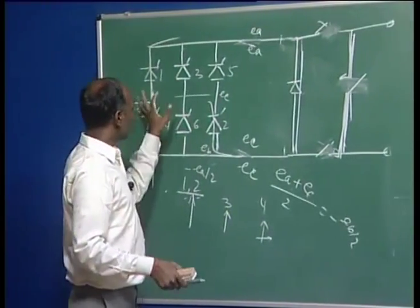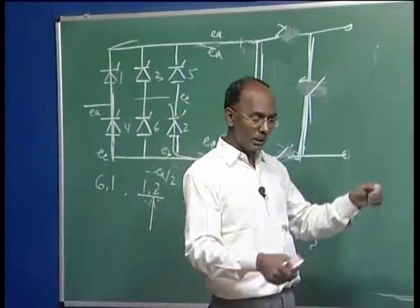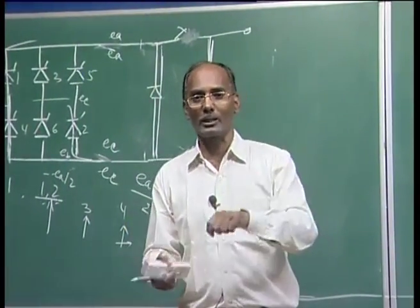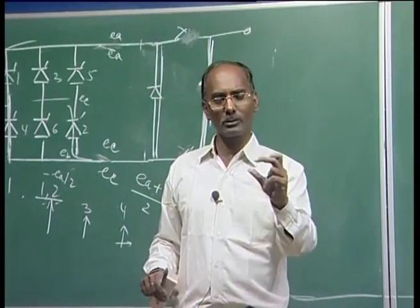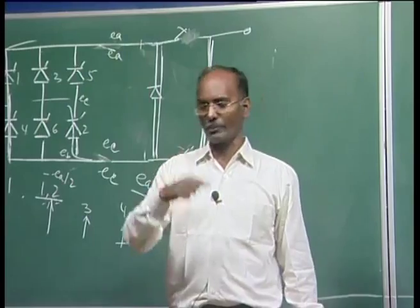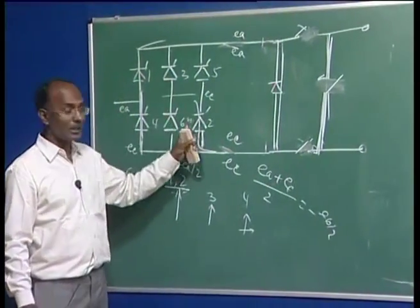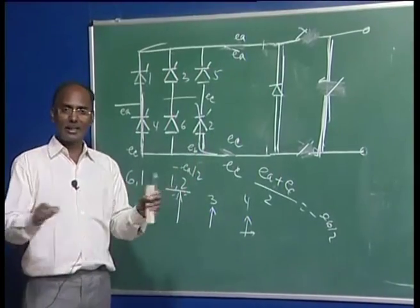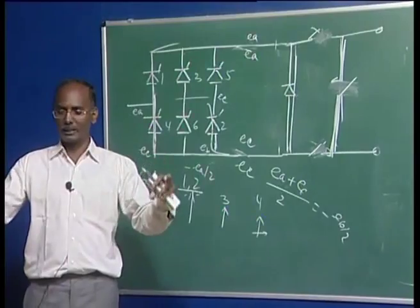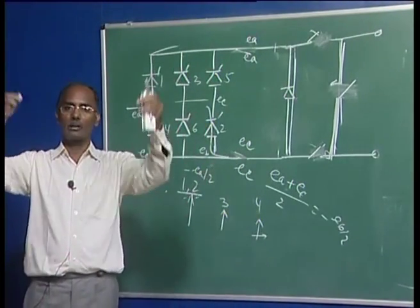So even though this is your rectifier as well as the inverter, once we are going to energize, we normally operate even the inverter as a rectifier. Rectifier means the voltage is 0, very small voltage. Normally we make beta equal to 90 degrees, approximately 90. So that is also a rectifier, this is also a rectifier, and it is just like the energization of an HVDC link I discussed. We go for 90 degrees, and then slowly reduce alpha and raise the voltage.